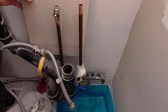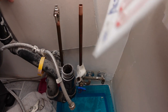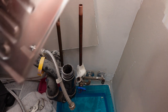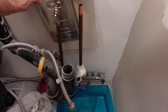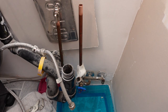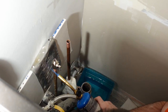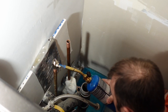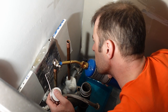For the first pipe I did all the fluxing off camera — I thought I recorded it, but I do record it for the second one. To prevent burning my house down, I take a sheet of old drywall and put it behind the pipes I'm soldering, and then I take a license plate from about ten years ago, fold it in half, hang it on the drywall, and put that right behind the pipe. That seemed like an effective way to prevent anything from burning or discoloring the paint on the wall.